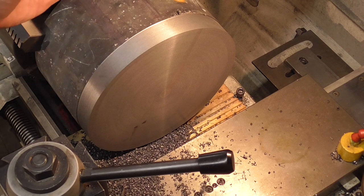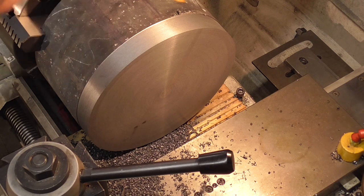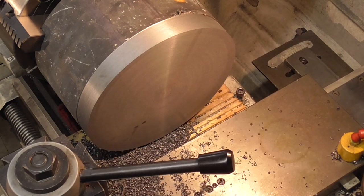So the center of mass of this slug will move from here down to about here. Be a little less wear on the bearings. And it also will just guarantee there's just no way that it's going to come off. So we're going to go through that and take it over, locate the holes, and drill them. Those holes won't matter in the end because I'm going to have slots there. And when I finally mill those slots in, they're going to end up removing the holes. But for right now, I'm going to use some holes to just help me do some locating and hold this onto here. So it's time to clean up for the day.